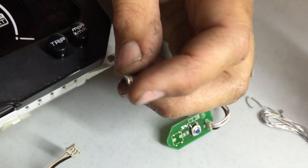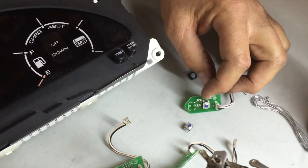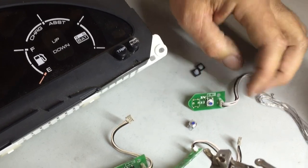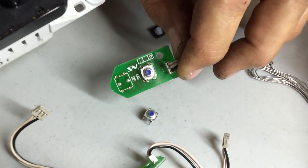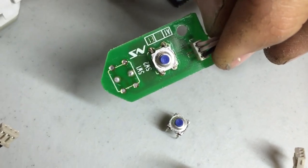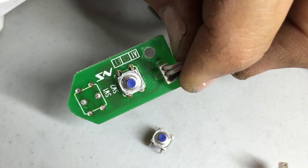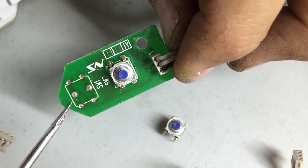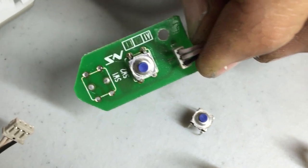If you're going to do this particular operation, you want to replace all four of the buttons on the right side and the left side. Just make sure that when you do it, on the little circuit board — we've got one of them already installed and the other side's cut off and the holes are clean to be able to re-solder. But make sure that you put the buttons on the correct side, which is where the white outline is on the circuit board.